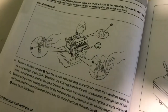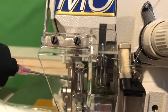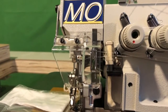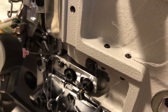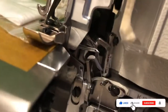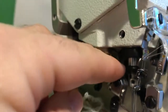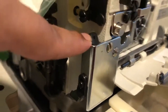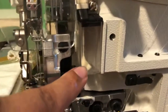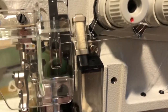The needle bar and the upper looper guide have to be lubricated. So the needle bar — just oil that and lubricate it. And then the lower looper guide — that bar right there. You can see the tip of the needle oiler. Just make sure those are oiled before you start sewing for the first time. Also, this one is full and it says to add silicone oil. This other one is very obviously empty. It has a little hole at the top and a little wick that soaks it up and wets your needle threads.